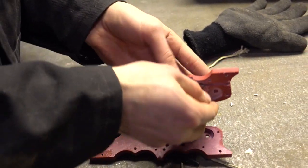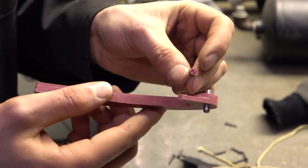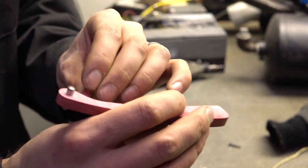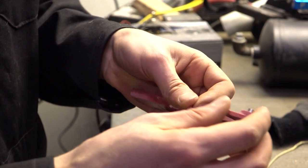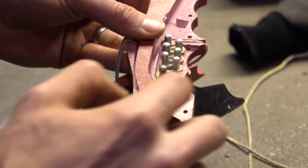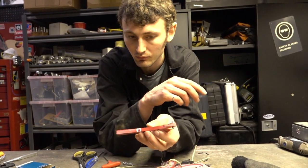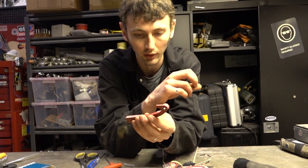Plastic, we've already broken it, but the plastic machines a lot faster, so for the prototype I just did it all out of plastic. See right here, here's the piece that broke off. This piece is supposed to be aluminum, just this little piece. That would probably take another hour, just that little piece. There'd be machine setup and all sorts of other stuff, but